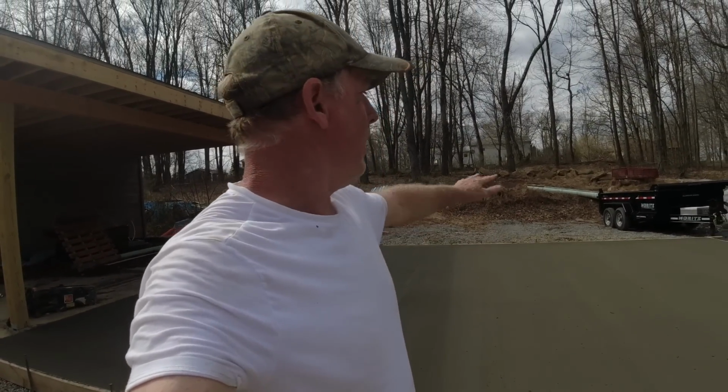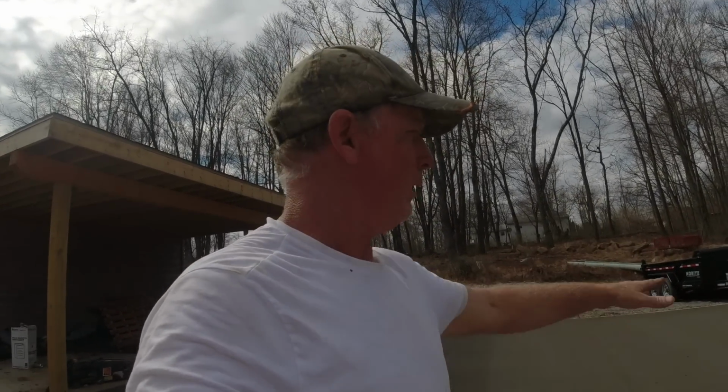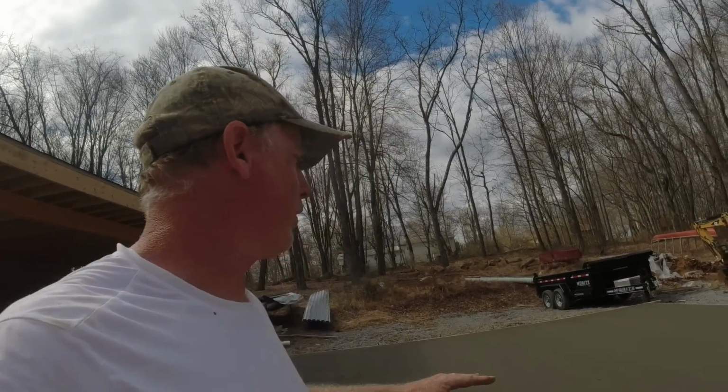Okay, before I sign off in this video, I'm going to get a lot of comments. Tom, you should wet that broom and it'll broom much nicer. Now, that's true. But when you wet the broom, now you're adding water to that surface and you're diluting the water cement ratio to the surface, making it a little bit weaker. I want this as strong as it can possibly be, just like all of our work.